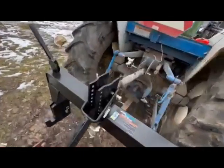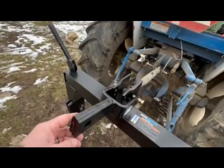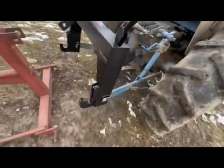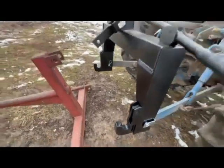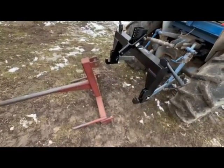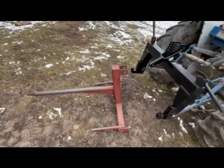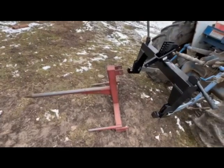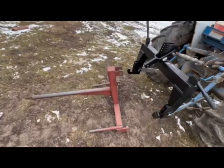We've got the top link in, and this will kind of swivel a little bit — that works as your top arm. The lower arms have these here, and there's a little lever that opens and closes. The issue is all of my implements are Category 1. This is set up for Category 2, so I'm going to have to convert this spear over. It's a pretty simple job to do. I've already done one, and between now and spring I'm probably going to have to convert every piece of equipment I've got.